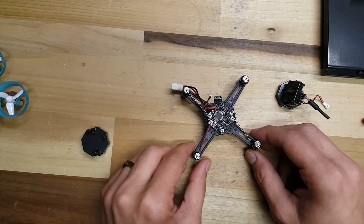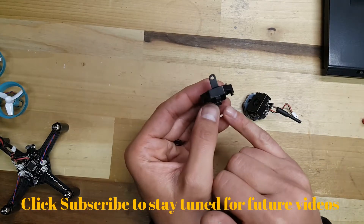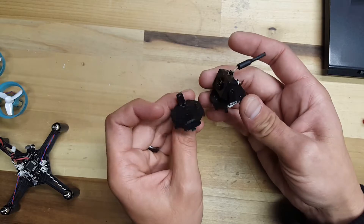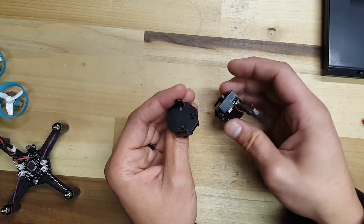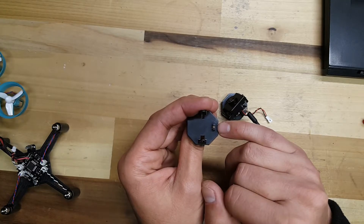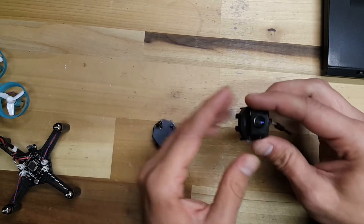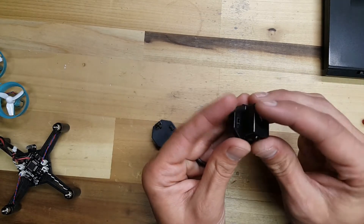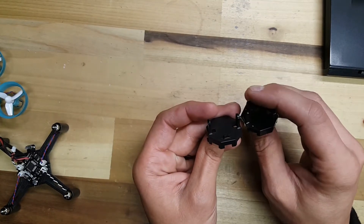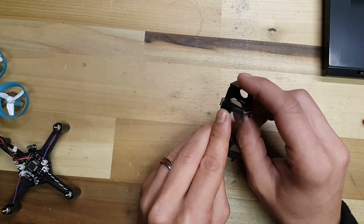This is how I mounted the flight controller. The modifications I had to make to the canopy were as follows. As you can see here, there are these little clips that hold it in — this is where the motor mounts are. I ended up clipping those away. And I'm actually putting this on backwards. There's a little clip here on the original that was used to harness the camera, the all-in-one camera power. What I did is I cut both of these little clips off so I can run the antenna through the front, which you'll see here. Then I cut the clips off the side that hold it down, and I actually widened the opening back here so I could put both the battery power and camera power through there.